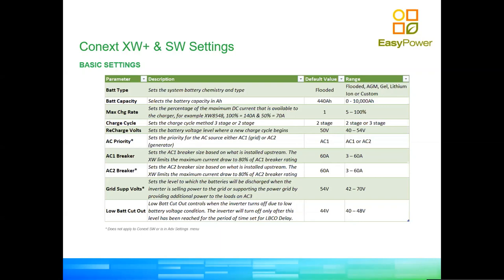Your lithium batteries can get to a point that is so low that the BMS inside of the battery might trigger the relays inside of the battery to disconnect. And then if left in that condition for very long, because of the hysteresis process inside a battery, you might get to a point that you might not be able to close those relays again, other than by logging into your battery directly with your battery software and lowering the limits of the battery to re-enable it. So that's why you want to cut the power discharge from the battery to the inverter at a point a little bit above the point at which you enter into a permanent protection of the battery, because that requires rescue. That requires you as an installer going to the customer site to log into your batteries and lower those protections to get the batteries to restart and take charge, which is not ideal.